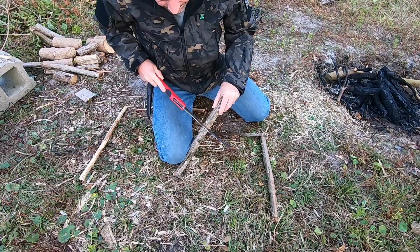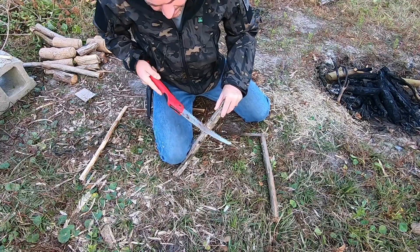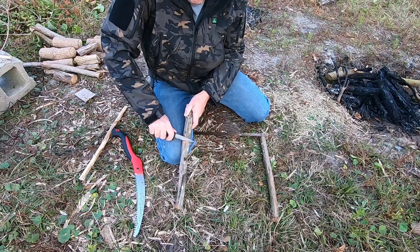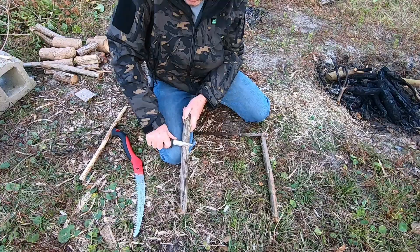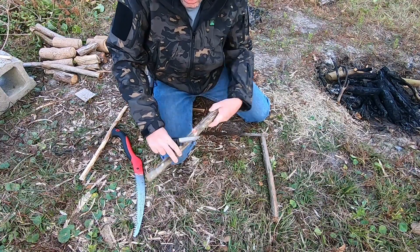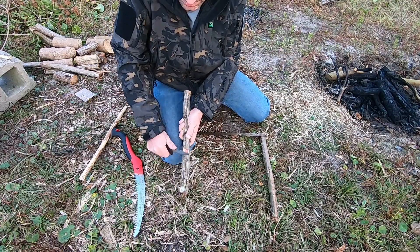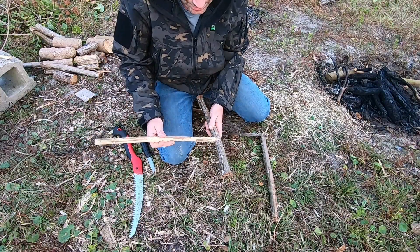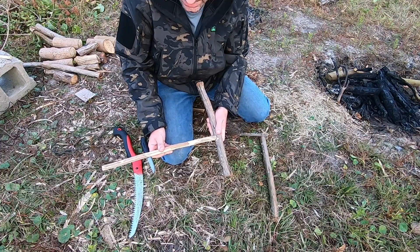I have our foldable saw out right now. I'm just putting little slots in our cut — the reason being, it just makes it so much easier when you come back to notch it out. You can always trim it much easier once you've already got it notched out with your saw blade. We're not going too deep — we just want enough to snug up our crossmember and have a place for it to rest. So our crossmember is going to go in here just like that. I might go just a little bit deeper to give it a little more bite of material.